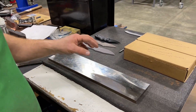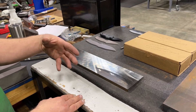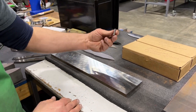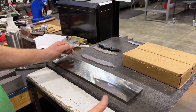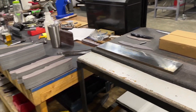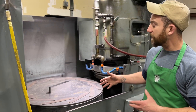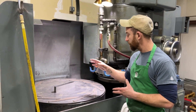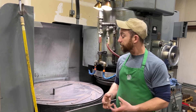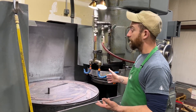Back to the Blanchard-style grinder. When looking at the table grinder, we knew based on some of these experiences that even in more traditionally stable materials like 3V, we were still getting some bowing, which we can use a carbide peener to hammer out and flatten. But they should be more stable. So when we got the Blanchard grinder, we spoke with the abrasives rep — they thought they had it figured out, they'd dealt with these steels and customers. The first wheel showed up and they didn't grind — it was too much force, too much pressure needed. We couldn't grind annealed, we couldn't grind hard. So we talked about that and got the next formulation. Fast forward a few months and this is iteration number seven.